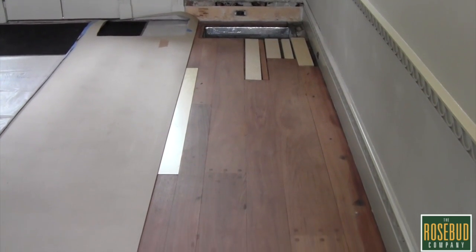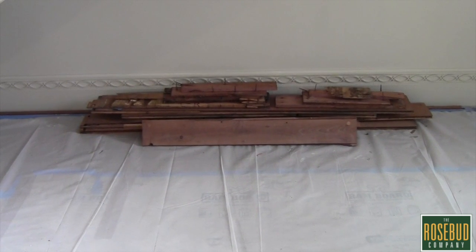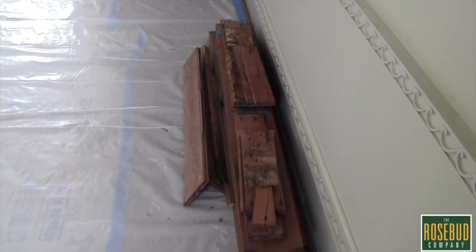We ended up with some nice product left over. We stacked it up — we had quite a bit of veneer that we were able to salvage, and that'll be used in the repair phase. I hope you enjoyed the clip and enjoyed watching Peter do his work — a very talented young man. In a situation like this, when you're doing preservation and restoration work, your number one priority is to salvage as much of the original material as possible. We were able to salvage quite a bit of good veneer intact. There was quite a bit that was badly damaged and could not be kept, but we did a good job and got a lot of material to work with. I hope to be able to show you that in a phase two of the repair work where we install the replacement material. Appreciate you watching, take care.